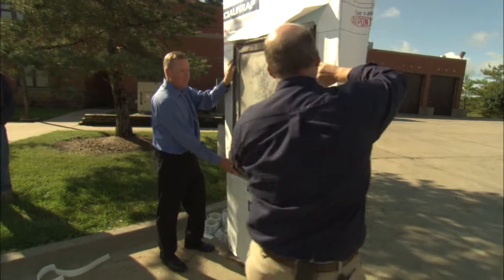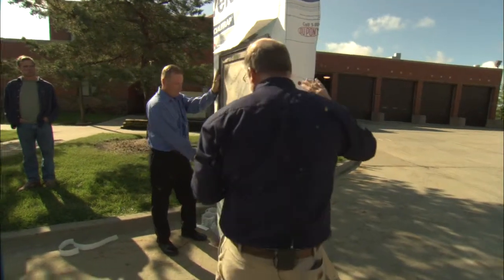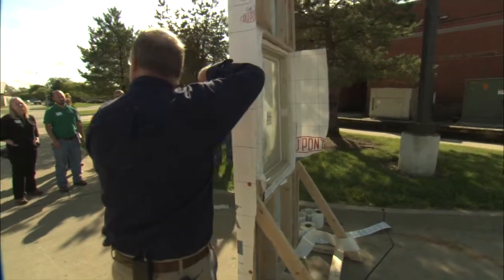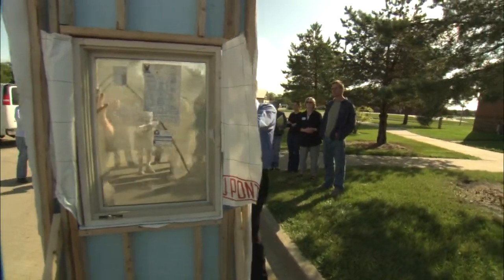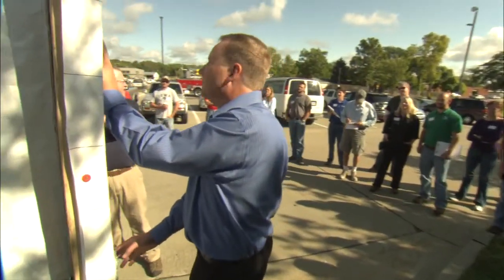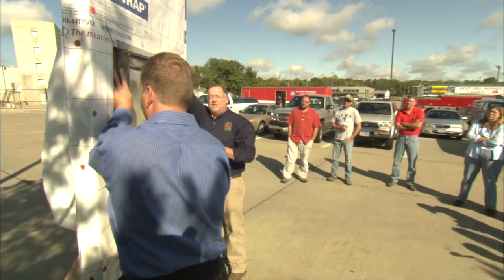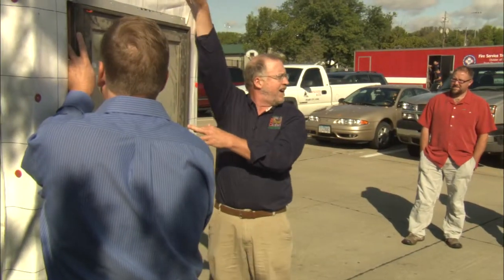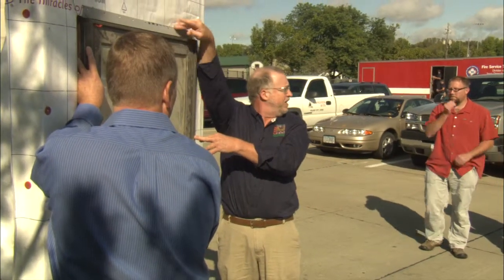Now it's sitting in the opening. For the house wrap, it would be all the way across the window. We used to just go like that with the house wrap and fold it in, then stick the window in so the window would be over the house wrap. We did that for years and years, relying on caulking behind this or some tape. Think about it — water gets behind the siding and then where's it going to go? Would you roof a house this way? Would you put your shingle on the outside? No.